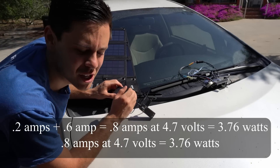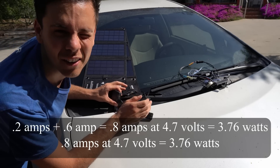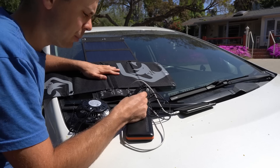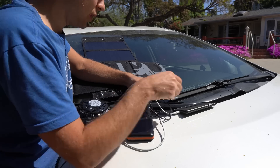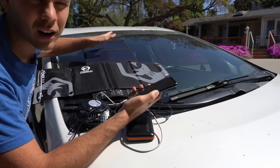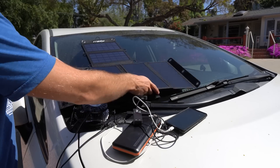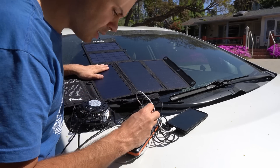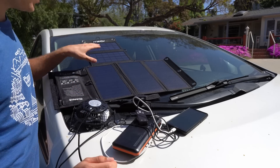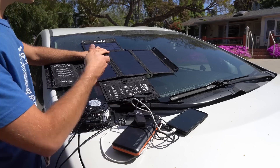If you buy cheap converter boards of any kind — even USB chargers for your home — they're typically going to be in parallel. For the next test, we're going to shade one of the solar cells. The output drops to 1.3 at 4.8 volts, which is 66% of the output, confirming the solar cells are in parallel, not in series. The same applies to the other panel: unshaded it's 1.07 amps, shaded it drops to 0.69. And shading two cells brings it down to 0.33 amps.